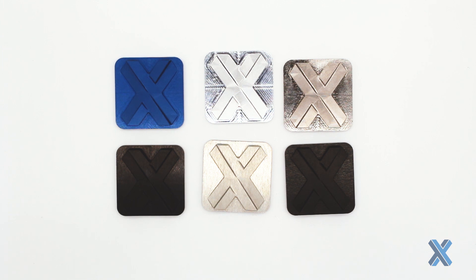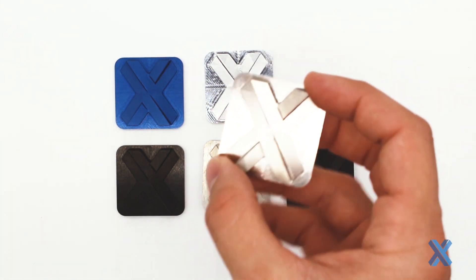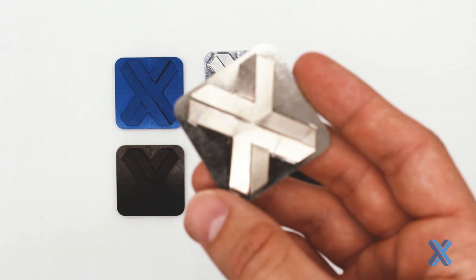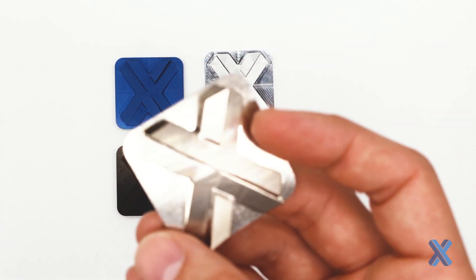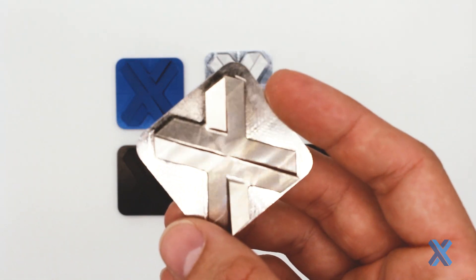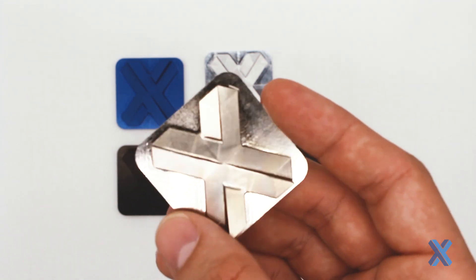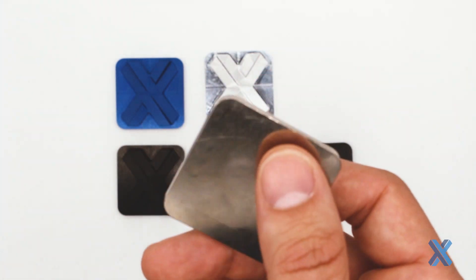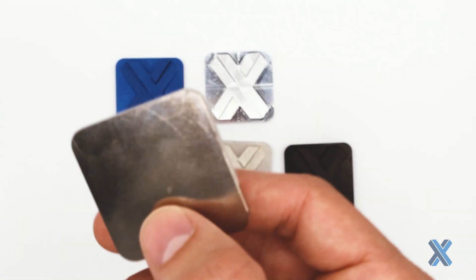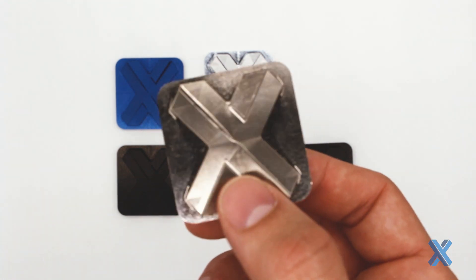On the other side of things, I can do something like electroless nickel plating. This part up at top here is an e-nickel plated part — and first off, it's beautiful. I'm taking an aluminum piece and putting a very thin coating of nickel on top, almost like an exoskeleton. It's increasing the corrosion resistance and the wear resistance, because nickel is a very hard, tough metal, and it's increasing the lifetime functionality of this part. Think about metal plating as almost an enhancer, an exoskeleton.